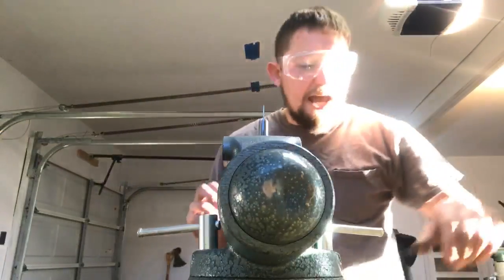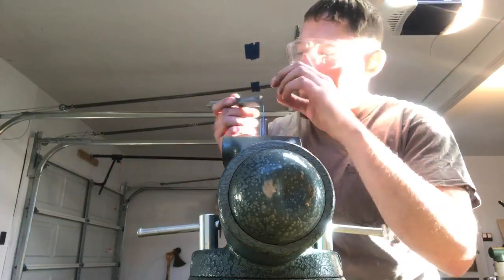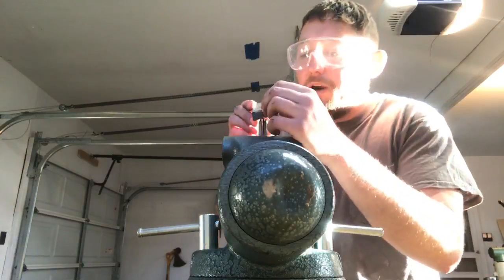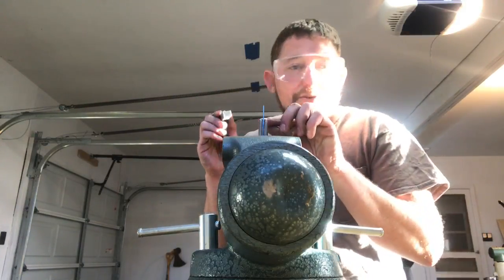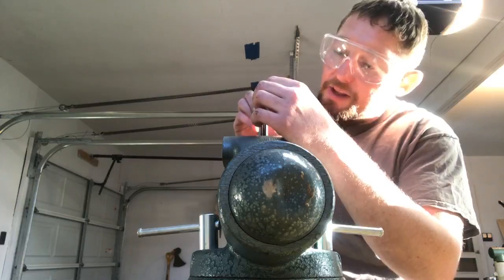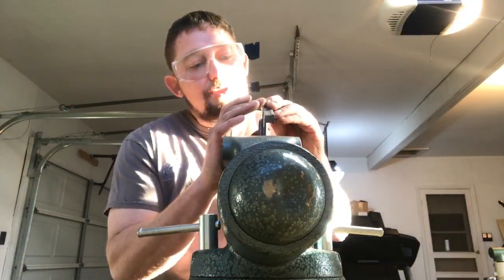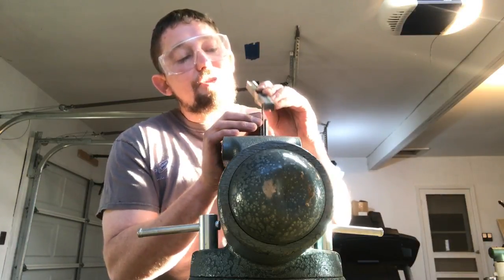Because sometimes that area contacts the inside of your lip, depending on your harp position, and I don't want to be cutting people's lips. I've ordered harps before, and they do that. Especially if there's not a recess and it's sharp there, it'll make like a little scissor and it'll draw blood on the inside of your lip. I don't like that. I like my harps to not be uncomfortable, not to do things like that. I'm just gonna do a little bit extra time polishing up.